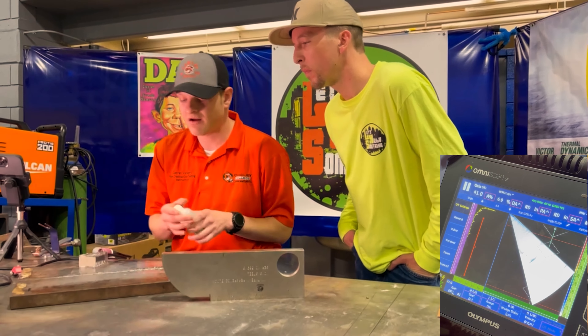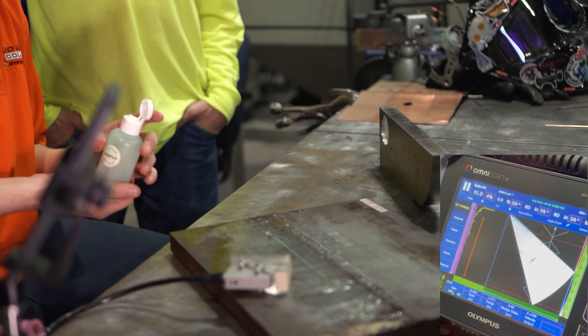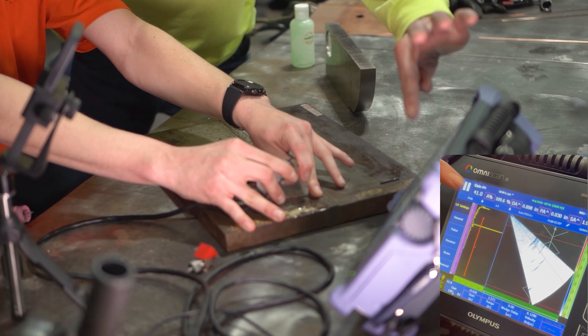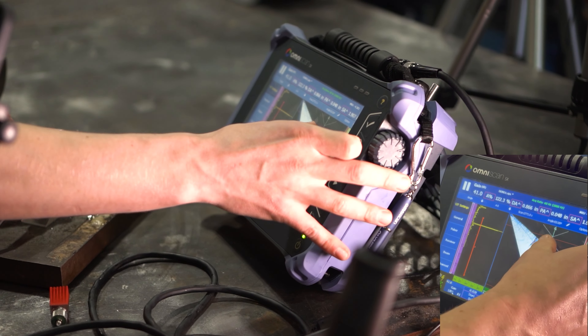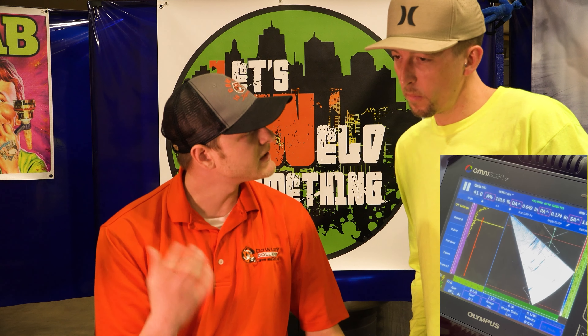I need to put some jelly on the belly because I'm getting sticky. And so we're going to just drag here — and bang-a-rang. That would be a defect on the weld face? Absolutely. Notice I said this is the bottom and this is the top of the weld — so that's my 70-degree sound wave going in and catching a lack of fusion on the lower bevel. We've got a double V-groove here, so I'm catching lack of fusion on this lower bevel on the nearer side to me.